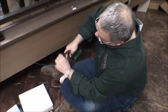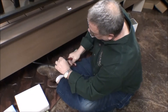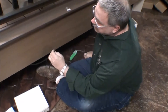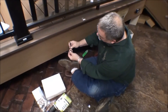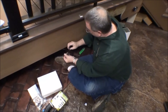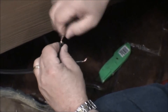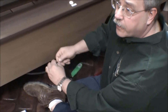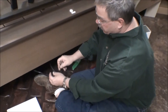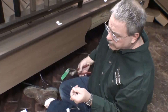So we've got this strip down. Notice both lines have the same coatings on them, so we're gonna reattach these now in the exact same order that we took them apart — the two lettered lines together and the two non-lettered lines together. Now this is normally done in a power-off condition. Even low voltage circuits — this is a 12 volt, 30 watt circuit — there's enough power to cause issues for people with a heart condition or neurological condition. So always do it with the power off to be safe.